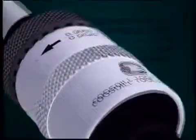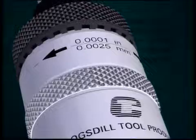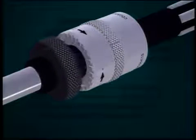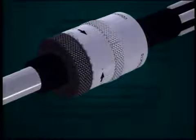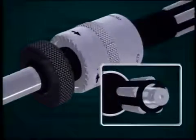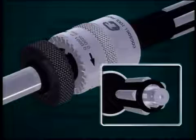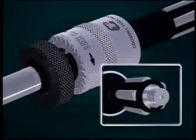The adjustment procedure for all roller finish tools is basically the same. As shown, the tool can be adjusted in one ten-thousandth-inch increments over a total adjustment range of forty-thousandths. A rear castellated adjusting collar interlocks with a threaded and castellated bearing collar to keep the tool in adjustment. To change the tool's adjustment, simply retract the spring-loaded adjusting collar and rotate the threaded bearing collar, which changes the position of the tapered mandrel relative to the tapered rolls and changes the effective tool diameter within the range specified for each tool.